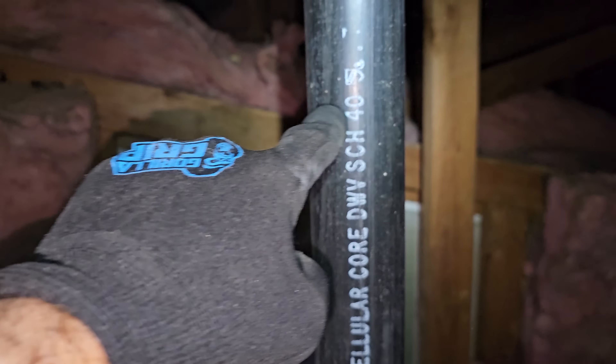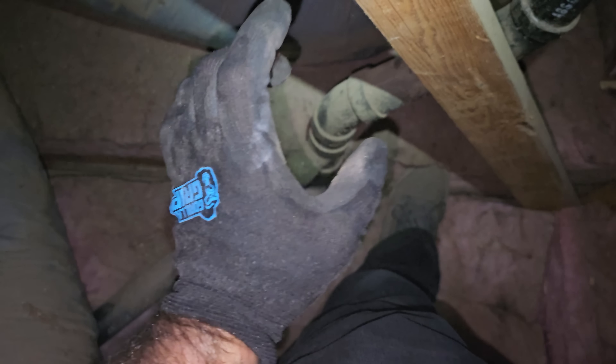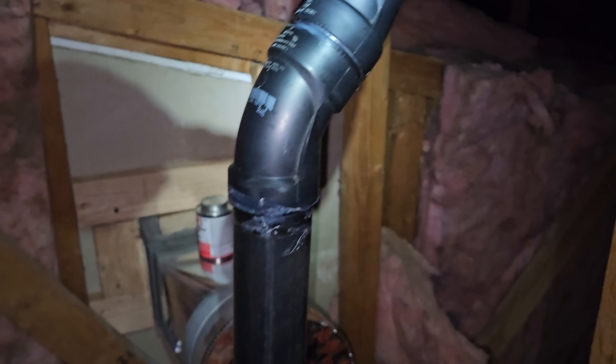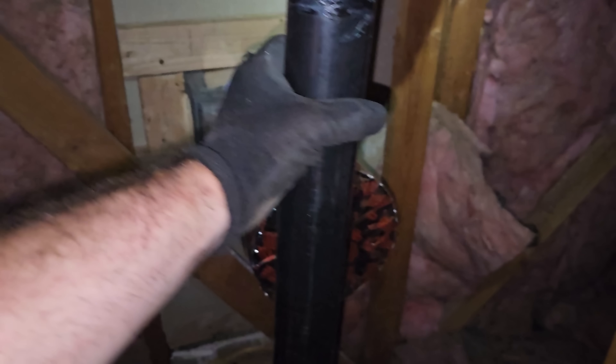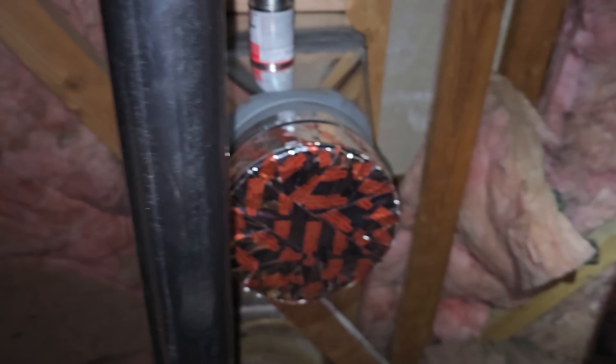When I cut in this boot I realized the stink pipe — the vent pipe for the sewage — was in my way. I'm going to relocate this by 45-ing it straight down. Actually, I'll try to cut this back and 45 it out of the way — that's going to be best. I've got a little bit of two-inch stink pipe and a couple of fittings so it shouldn't be too hard. It's not the prettiest thing in the world — if I had bought street 45s it would have been easier — but it's all in and glued, and now I've got a direct shot to hook up flex duct without kinking it.